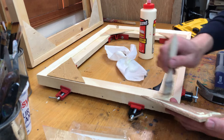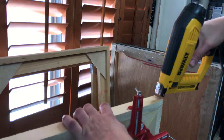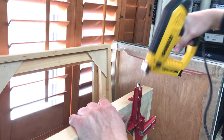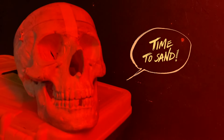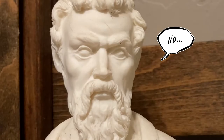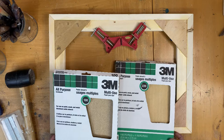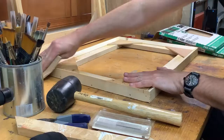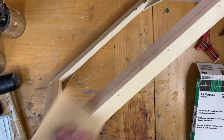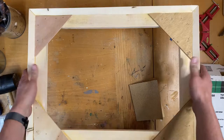After getting all the triangle braces in place and secure, it is time to fasten the outer corners. Flip the frame on its edge and nail through the 45-degree cut, pinning both corners. The cross anchors will ensure the outer corners have good surface connection to allow the glue to do its job. Repeat the process on the three remaining corners. A one-inch to inch-and-a-half finishing nail or wood screw will do the trick. After the glue dries, it is time to sand using 100-grit sandpaper. The lower the grit, the more coarse the sandpaper. Go around the whole surface — especially what comes in contact with the canvas — the top of the bevel, all four corners, and the entire back edge of the frame. We are looking for a semi-smooth edge and no rough areas. Finally, check all the joints and edges one last time, then it's ready for canvas.